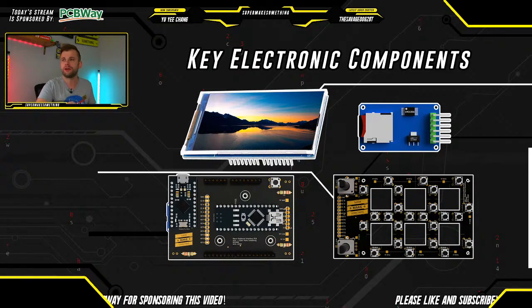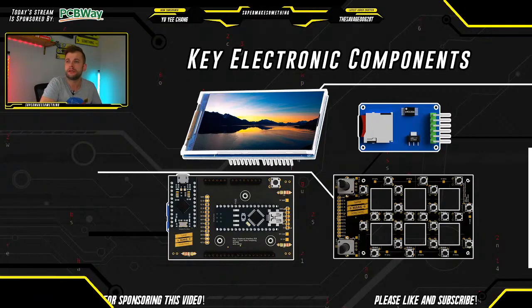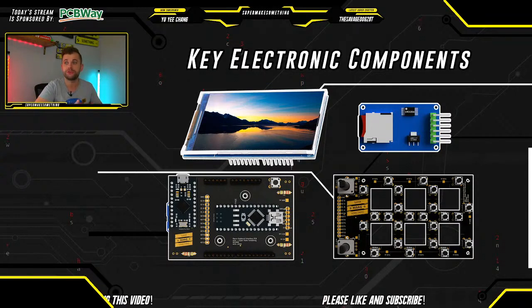Of course, we then have the two PCBs. In the bottom left, you see what we call the motherboard PCB, and this motherboard PCB has connections for mounting an Arduino Nano, which is responsible for driving the screen and accessing the SD card reader, as well as an Arduino Pro Micro. And the Pro Micro is a key component of this build because unlike some other Arduinos that are this size, this Arduino has the Atmega32U4 chip.